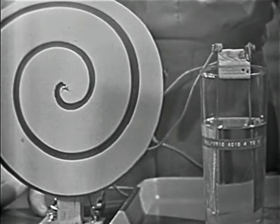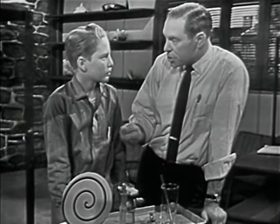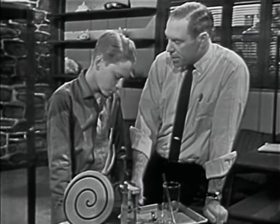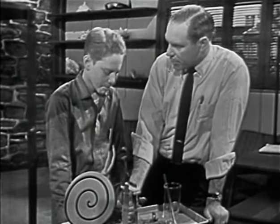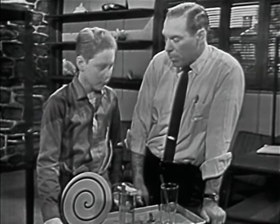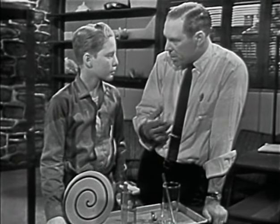Then the second thing: as the reaction begins, the sulfuric acid begins to attack the zinc and chemically changes some of the zinc to some other materials, and some of those other materials are deposited right on the zinc to prevent the sulfuric acid from reacting with it. Does that mean that it can't get to it? It can't get to it, yeah. And that's called polarization. Where do we stop? Well, in dry cells, they have chemicals in there that prevent this from happening.